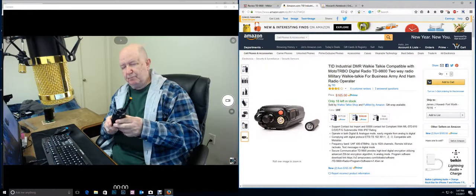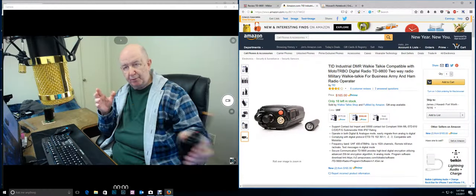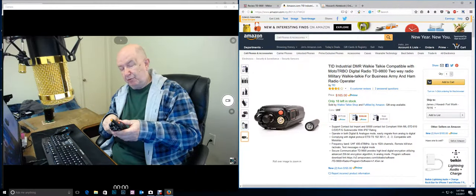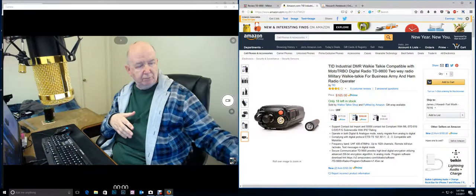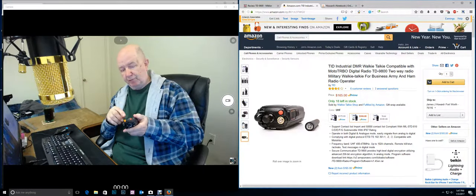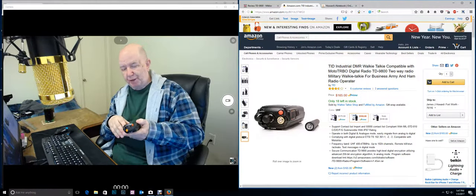Motorola and other companies will let you use their repeaters for a price. So you'd get a vastly increased range. If you're a small business in a small area, you can talk unit to unit. If you need wider coverage, there are companies that, for a small amount of money, you would put in their frequency for their repeater, and the information that they would give you. If you're signing up with them, I'm sure they'd set your radios up for you to get you as the customer, which would be very easy for them, or you can do it yourself. But you'd put in their frequencies.